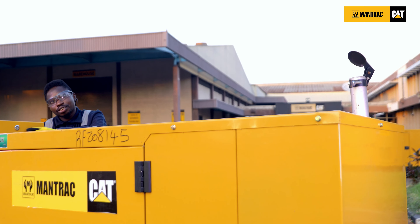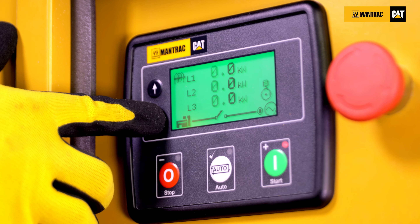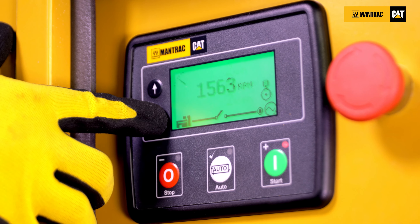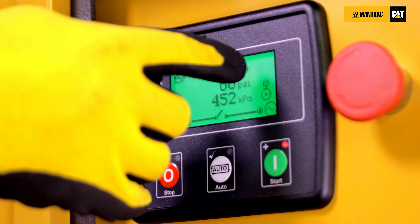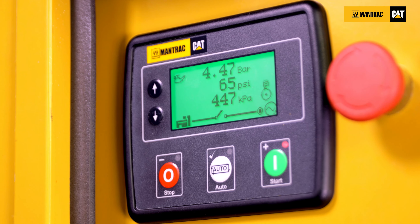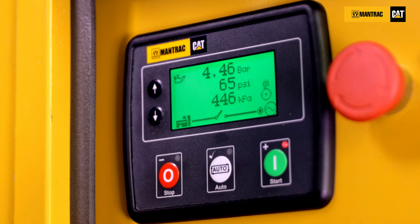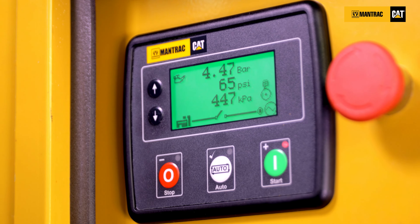Now the gen set is running. You can see you have a piston symbol. 30 seconds has passed — go and check your oil value. Now you are having four point six bar, which shows a good value, because any value less than one bar means you need to engage the emergency button. But now that you are having a good value, your engine is good to go.